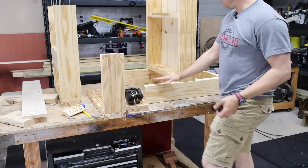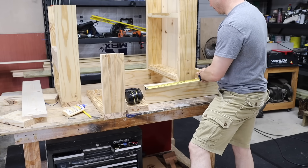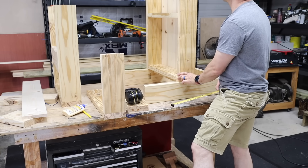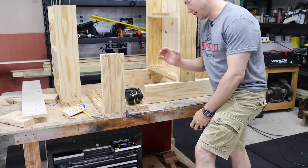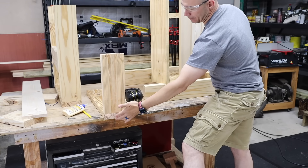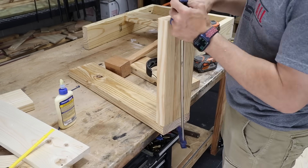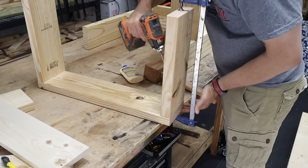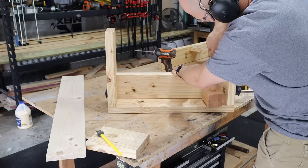So this is the short side of the sectional. I've got it standing up here so I can get my measurement. I'm building the short leg for the back and I know I'm going to need it to come to the same as this is — 16 and a quarter from the bottom of the leg up to the top of this two by six frame. I'm going to build this the same to go on that back corner because there will be a one by on top to make it 17 total. And for the short leg, make sure to put this support in there up next to the top so that you'll have something to attach the frame to.